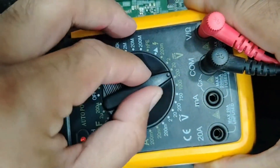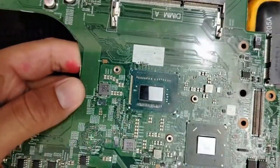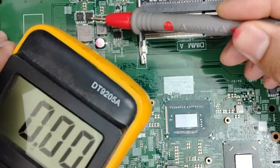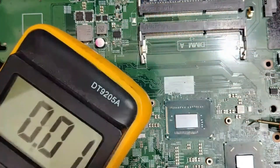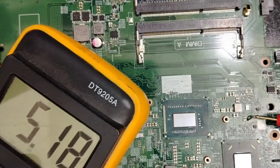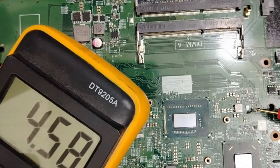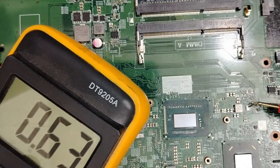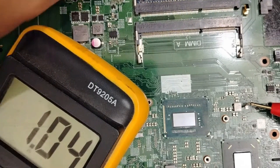Back to the voltage — 20 volts. Repetition: without repetition nothing will be clear. So 5 volt here, we have 5 volt. 5 volt will travel from here to this input, this ceramic capacitor — we have 5 volt. In all capacitors here, input or filtering capacitors, you will find 5 volt. This 5 volt will be applied to this driver.